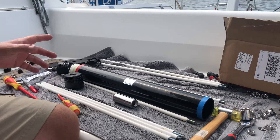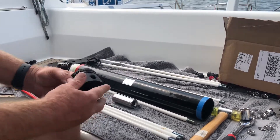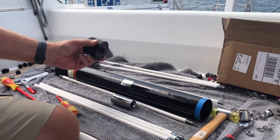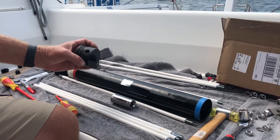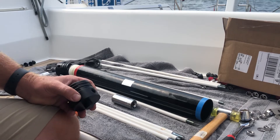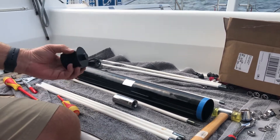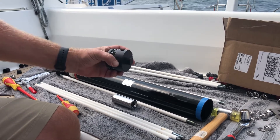Once you free the cylinders from the housing, you've got these end caps with the o-rings. The document says to put this in a vice, which is what I ended up doing. The tech rep for Desalinator in Spain mentioned something about using water pressure, but I wasn't able to follow up with him before starting, so I went with a vice. These things are sealed pretty tight — you put the end cap, I guess it's Delrin or something, into the vice.